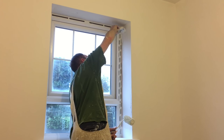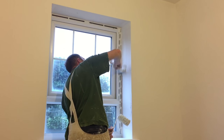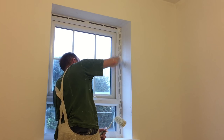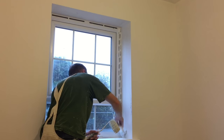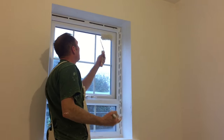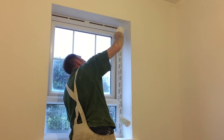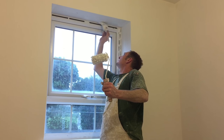The first thing I'm going to do is cutting — cutting the top of the reveal right there. And like I say, there's tape on the window to protect it. Some builders will actually take it off before it's painted, which is a complete ball ache. But luckily on this plot the tape's still on. Now needless to say I can hit the windowsill with the paint. Right, so I've actually cut that bit. You might find sometimes that you've got to go into this corner a bit — just let it dry a bit and then give it another coat.